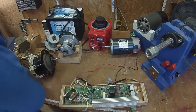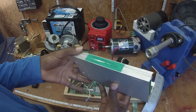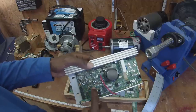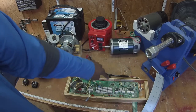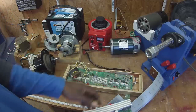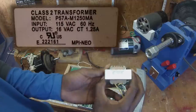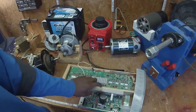What you see here are a couple of components. This right here is an MC2100 speed controller — it comes in a lot of treadmills, and as you can see on my blown-up version it says MC2100 WM. This particular speed controller doesn't have the potentiometer tabs on it, which means you're going to need both the console and this in order to control the speed. It also comes with a transformer that drops the voltage from 115 down to 16 volts AC, which is needed for your speed controller board.